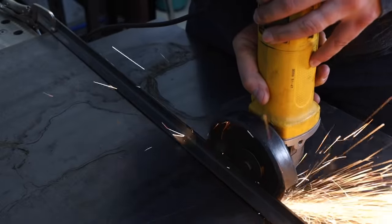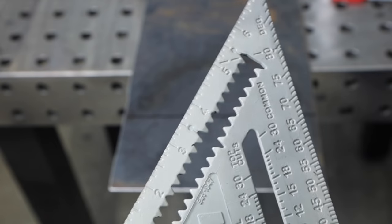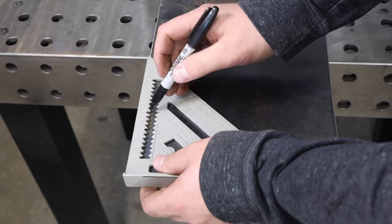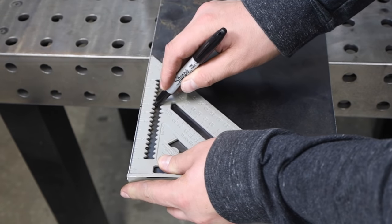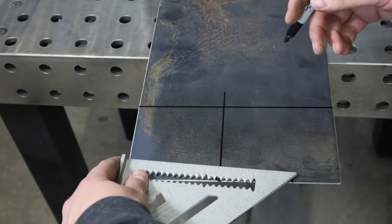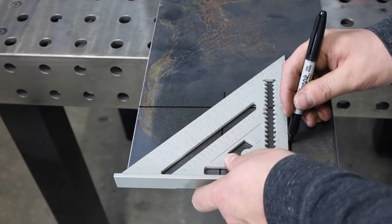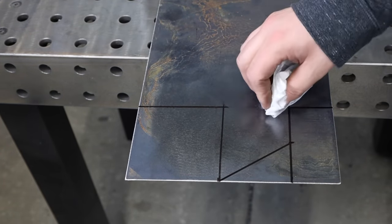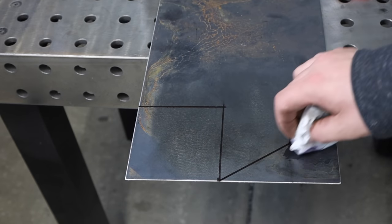The next thing you usually have to do with sheet metal is create a flat pattern — there will be bends and welds as part of the process that come later. One thing I really love on this speed square is it has notches where you can put a marker, pen, or scribe and just slide it along to make a line right where you need it. I mark all the way across at the critical dimensions to make my cut lines, but there are portions I don't want to cut, so I erase those using a rag with some acetone — wipes right off clean.